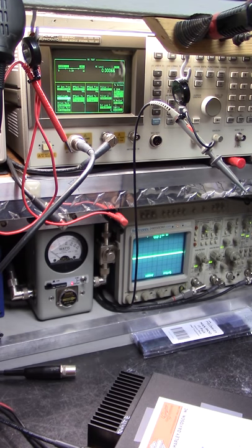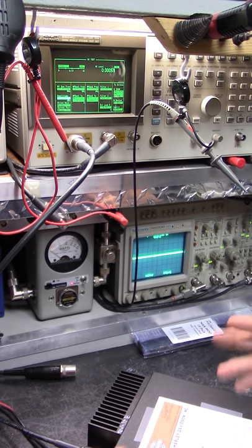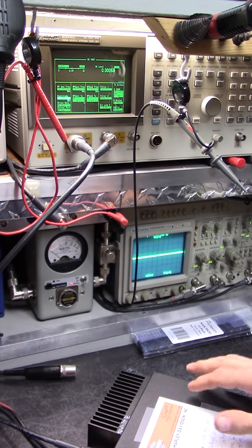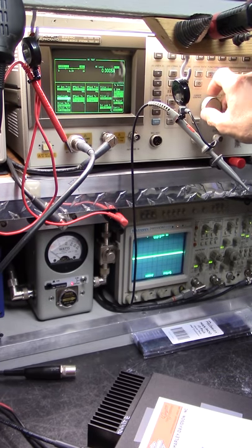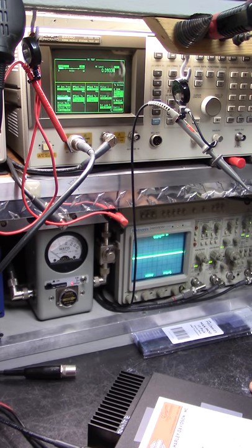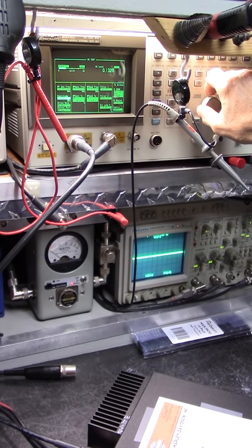The lower you go, the more accurate it is. On all actual service test equipment it's 10 dB SINAD, and you go by basically what the radio manufacturer stipulates. If it's lower, it's always better — the higher, well, anybody can do that. So at 10 dB SINAD on this one, we're down like 115, 116, 115 — or at 12, 113.